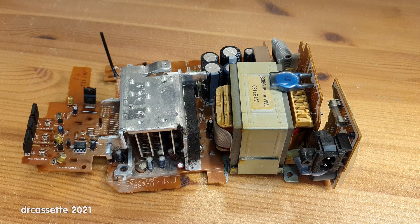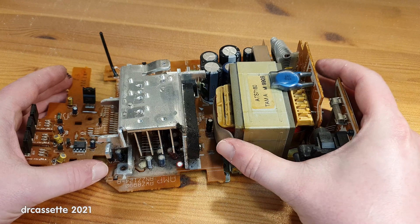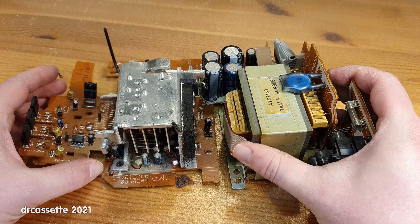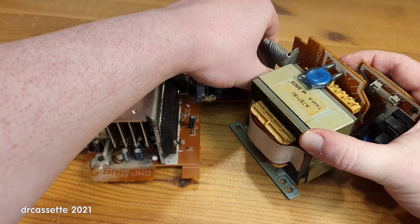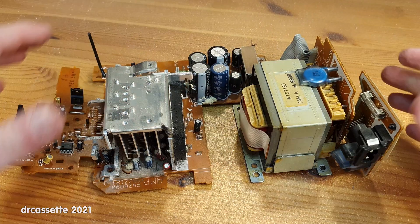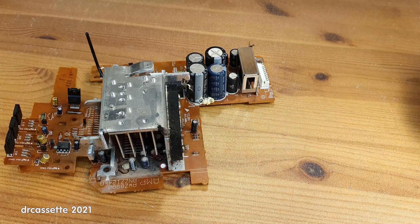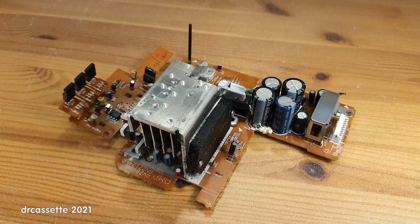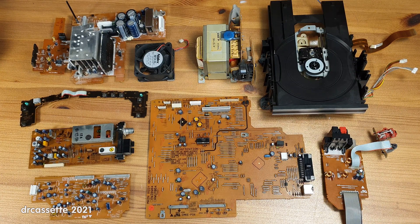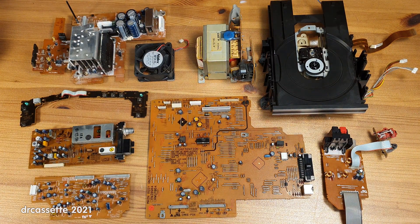But it has also been worth it for another reason — I think it's quite fascinating how this system was put together and how they have stuffed and squeezed everything into this small case. There is another connector up there, and it's a push-type connector — the transformer with the primary side circuit board comes off, and that leaves us with the board with the power supply and main amplifier. With all the modules that once made up the system laid out like this, you can really tell how much they managed to squeeze into a relatively small space. Thank you for watching.